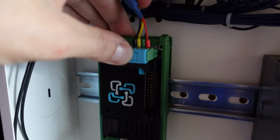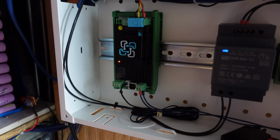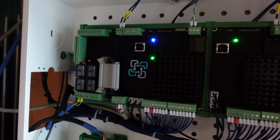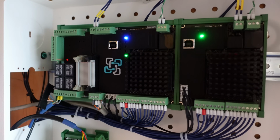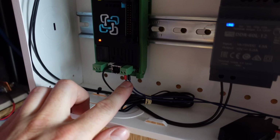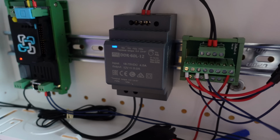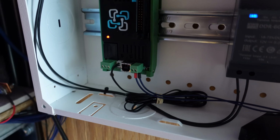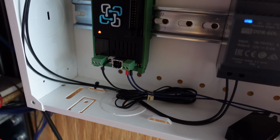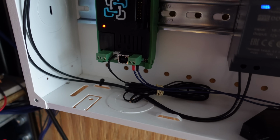Okay. Now this is where my setup's going to differ a little bit, because I cannot decommission this Watchmon 5 yet until I have my lithium iron phosphate ready. So rather than plugging in pack voltage for my input, I'm just connecting to a tap off my 12-volt Meanwell isolated DC power supply for the time being. And then once I'm able to move away from the 18650s, I'll reconfigure the power input for this.